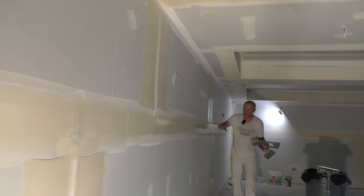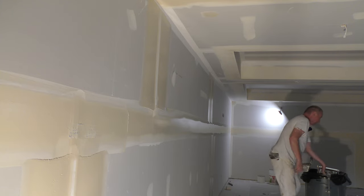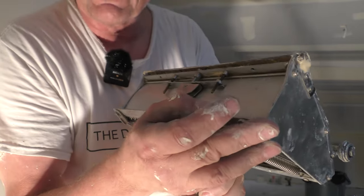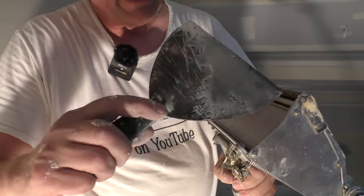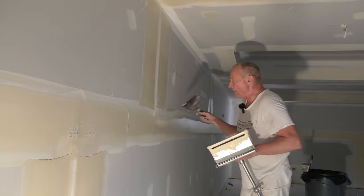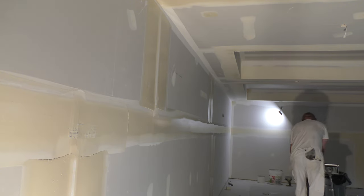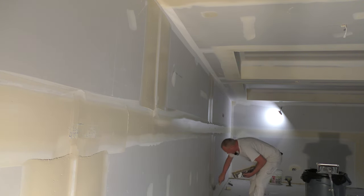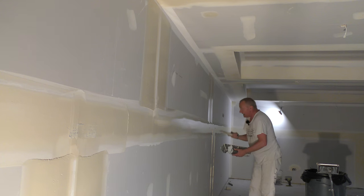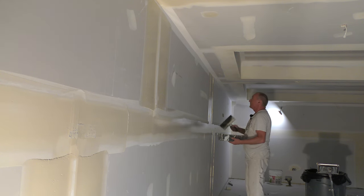Now what I will do is look at the seam, and if there are any heavy edges — there were some back here — what I did, because I know my 10 box blades are getting bad right now, is I took my 6-inch knife and gave it a quarter turn and the edges are gone. If I have a little bit of an edge I cut it off — I don't have to mud it in, I just remove it. This is beautiful, just beautiful, ready. Don't be a mechanical taper — just look at the job, look at what you're doing, and take it from there.